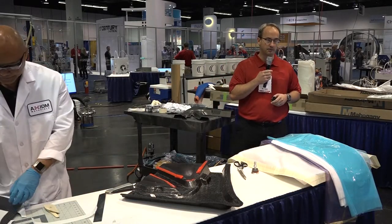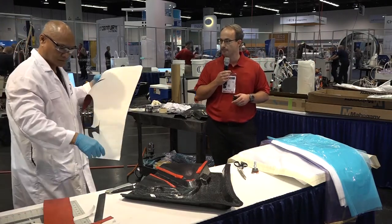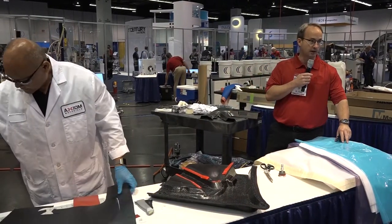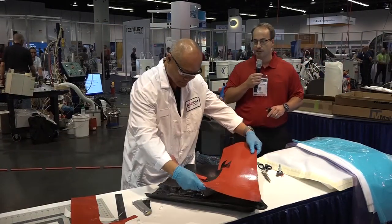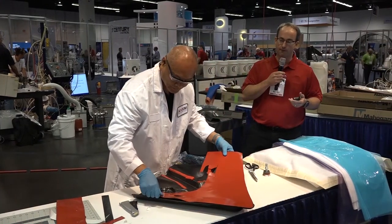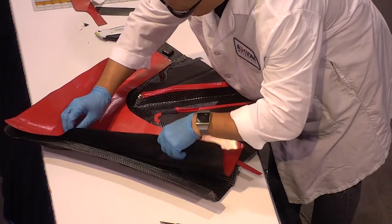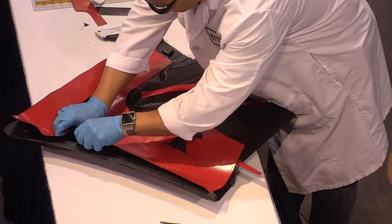There are various different fabrics available — we can have unidirectional fabrics and tows. Once we've finished laying this part up, it's going to be vacuum bagged. We have our breather stack ready to go. Then we'll put it in an oven and cure it anywhere from as low as 100 degrees Fahrenheit up to about 350 degrees Fahrenheit. The higher the temperature, the shorter the time it stays in the oven; the lower the temperature, the longer the time it stays in the oven.